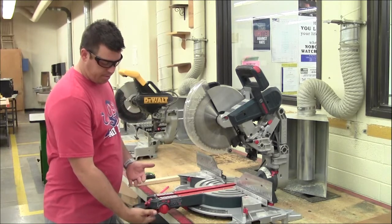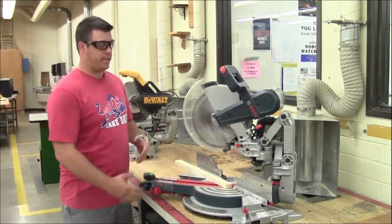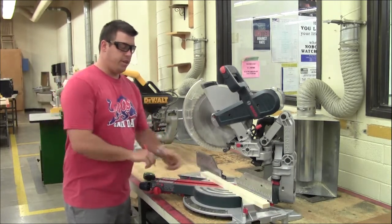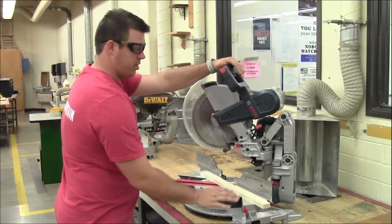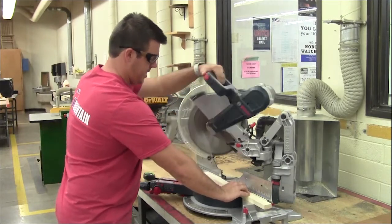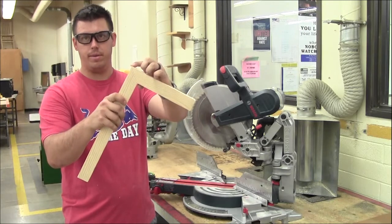There's a little trigger that you push up and then you can move the saw left and right. I'm going to set this up at 45 degrees. When you're cutting this piece of wood, you can see there's an open side and a kind of closed side. The angle for the open side is 45 degrees, the angle for the closed side is 135. When making a cut like this, you're going to want to hold it on the open side and then use your other hand for the trigger. So since I'm holding with my right hand, my left hand operates the trigger. So I'm going to make my angle cut there. If you put two pieces that are cut at 45 together, you can see those angled cuts join up.